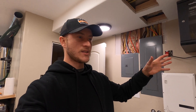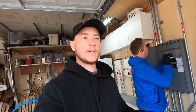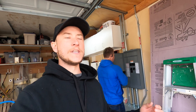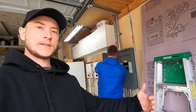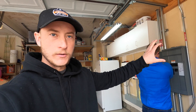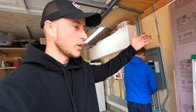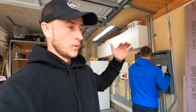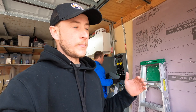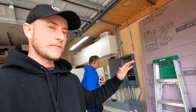This array is producing seven kilowatts right now, but the house only needs maybe two kilowatts. Historically, with backup systems you didn't have very much output from the solar panels. The best way to do it would be to take a critical loads panel, install a few breakers in there, and then you'd be able to run some of the loads in your house — so when the power goes out you could back up lights, maybe the Wi-Fi router, but nothing crazy.